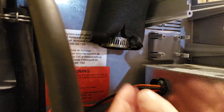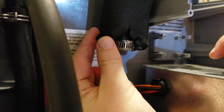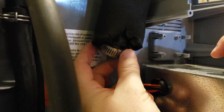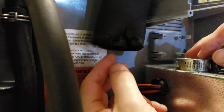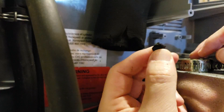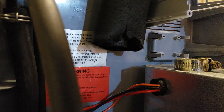When I did the install of this thing I probably pushed this insulator down too far, because you can tell it got overheated — it's flaking off into little burnt chunks of rubber. So I'm going to cut that back a little bit because it was probably down too close to the tank.